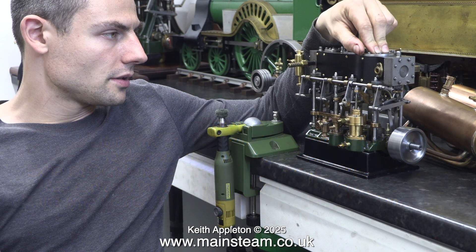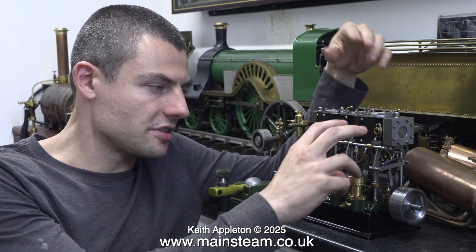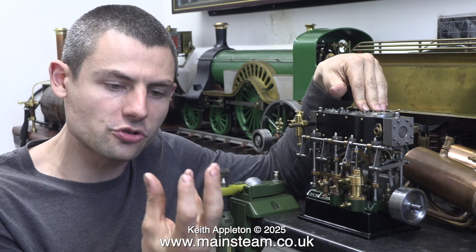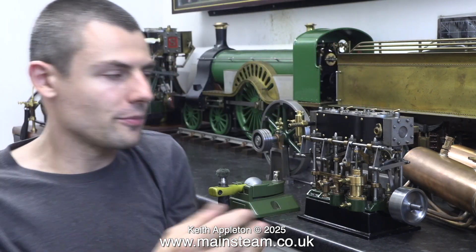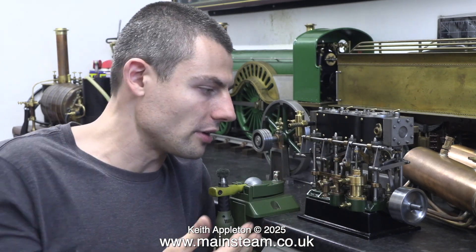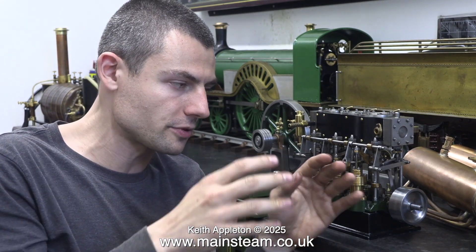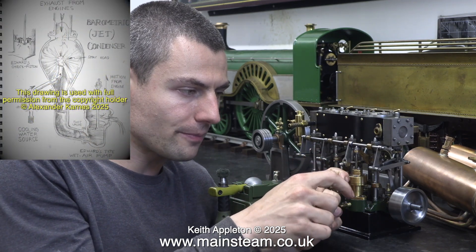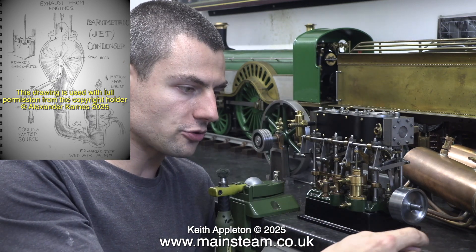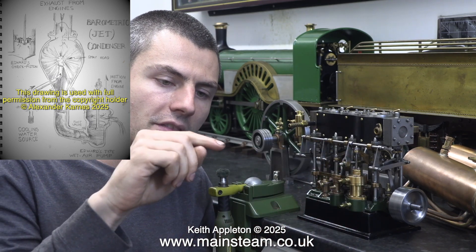After this video I'll look at condensers in an entirely different way. The separate condenser is affixed to the side of the steam engine, or somewhere else, and consists of a closed chamber. The closed chamber is connected at the top end to the exhaust of the engine. In this case we have a marine triple — no better way to show off a condenser. There's a small cooling water pipe that comes in through the side of the chamber, and once inside there's a little spray head.